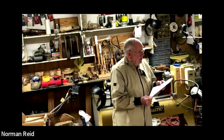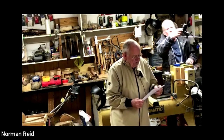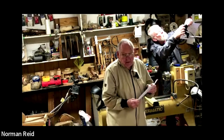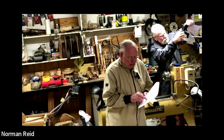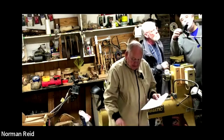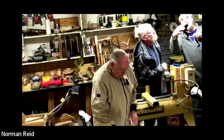There's a piston fit where both of the insides are parallel to each other, and it fits. It's a cylindrical lid flange over a cylindrical base flange. We'll learn how to make the cylinders. And then we have the suction fit, which has a slight curve to it, and that's really the secret on the base flange to getting a nice fit where the box can be turned upside down and the lid will stay on.